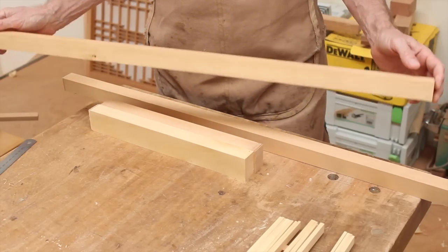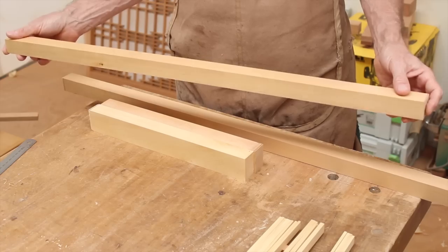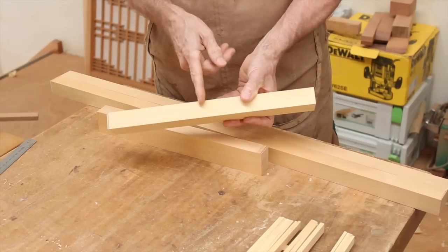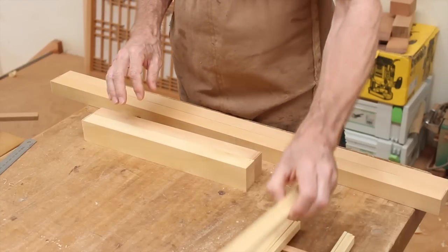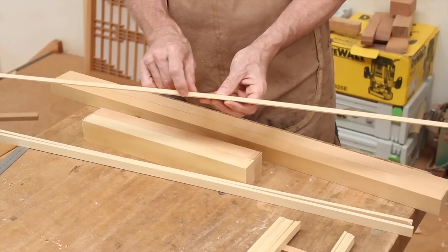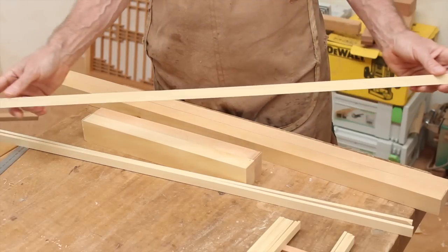The timber we need for this shoji is 2 stiles, 30.5mm by 30.5mm and 850mm long. The final length of the stiles will be 750mm, but allow an extra 50mm on both ends. We need 2 rails, 45mm by 29mm and 350mm long. 3 tsukeko, with a mitsuke of 6.5mm, mikomi of 16mm and 700mm long.